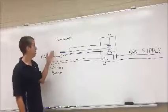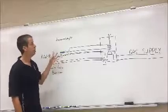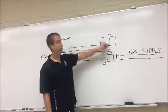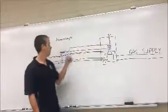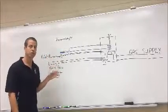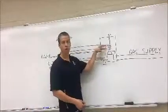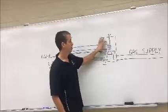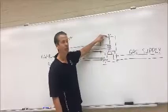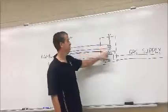It starts heating this thermocouple. Now at the beginning, because it's still relatively cool, it does not produce enough voltage needed to keep this in the down position. So that's why we have to keep holding until this thermocouple gets hot enough that it produces its maximum voltage of 26 to 32 millivolts. And now we have this fed in a coil over here, which will create a magnetic field and maintain this in the down position.